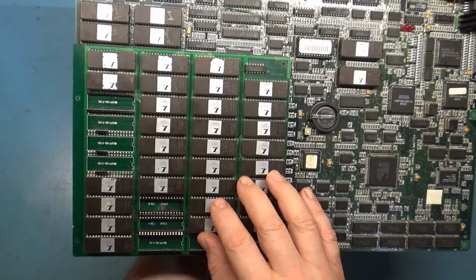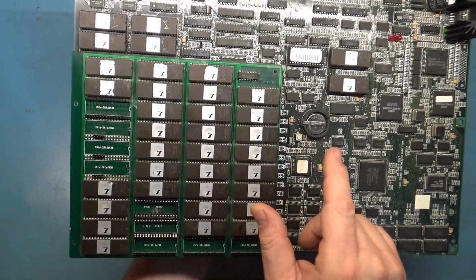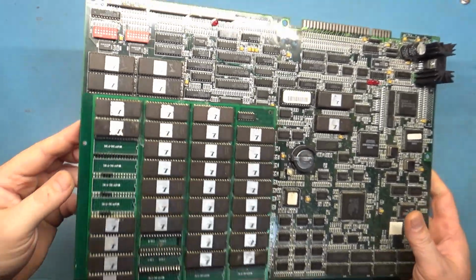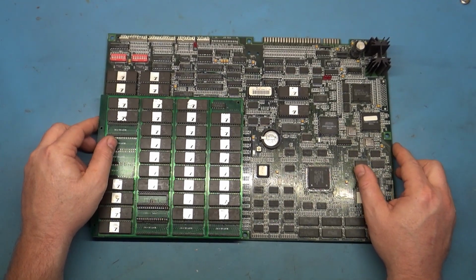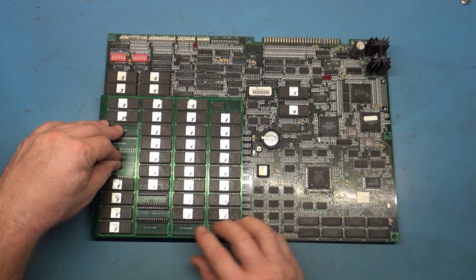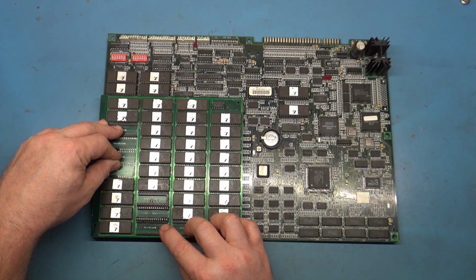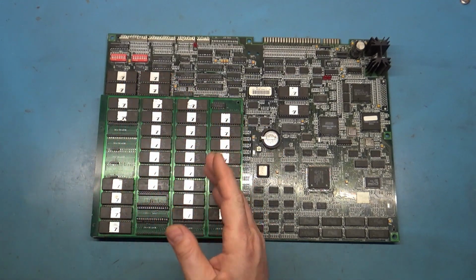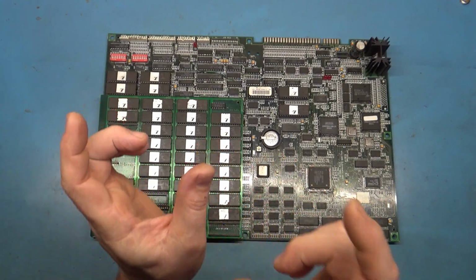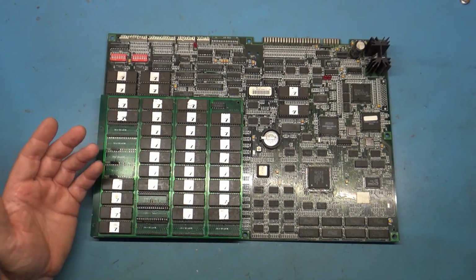These are notoriously known for being bootleg ROM labels. According to the MAME dev that I was talking to, this is a bootleg of some kind. But I don't understand why they would need to completely recompile and recode the ROMs. They should be able to take the 8 megabit ROM, look up the code, split it in half, put the first part of the code onto a chip, the second part onto a chip, and use 2 4 megabit ROMs. They shouldn't have to completely recompile the code.